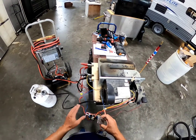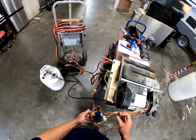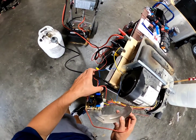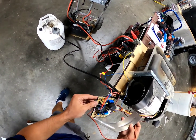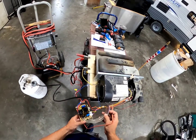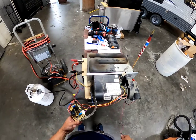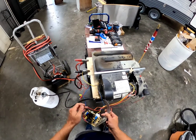I have the switch off so that I can cycle it for the purpose of this video. So we have our power coming in. If you look at your board, there should be spots labeled — this one does say power. We see our piggyback wire, which then through our switch goes up for our thermostat. We have our blower motor — it's also a red wire, so don't get confused with red. There's a lot of red on here, and a lot of blue. Then we have a third red wire that's actually coming back from our sail switch.